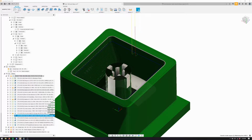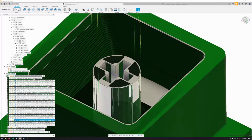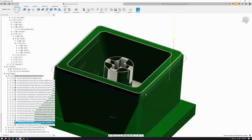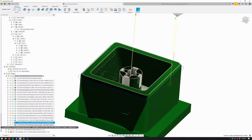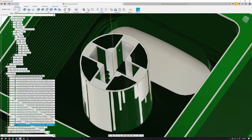So chamfer the inner side, just an edge break basically. Another edge break. This trace actually goes through the center using a center contour. So it's a chamfer, but I'm hitting both edges simultaneously. Then there's an outside chamfer, and it's a little bit slower because we're leaving material on the outside because I want to finish the outside during the op 2, but I still want the bottom to not have a sharp edge. So essentially we're making a really big chamfer here with the intention of cleaning it up when it gets flipped for op 2.